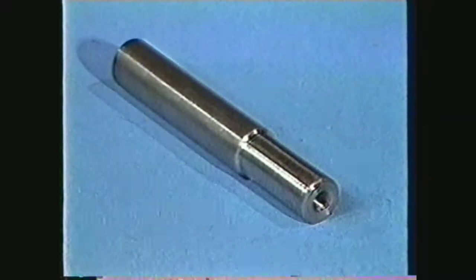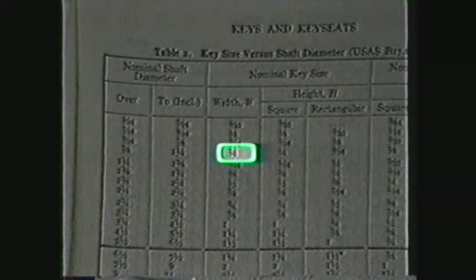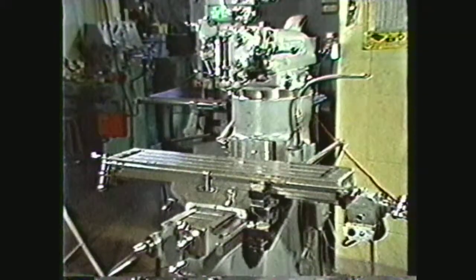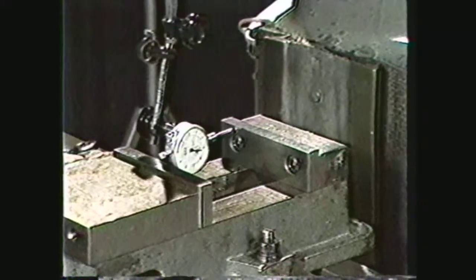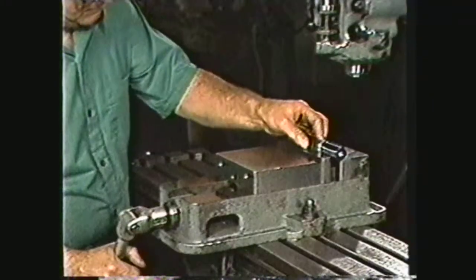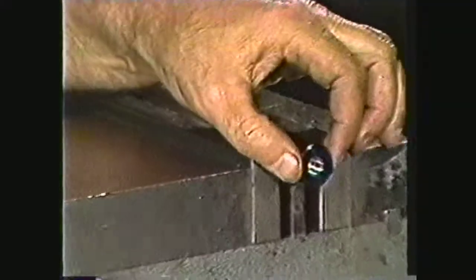In this demonstration, we will be using a 7⁄8-inch diameter shaft. The table in the machinery's handbook shows that a 7⁄8-inch diameter shaft will require a 1⁄4-inch square key. The keyway will be cut with a vertical milling machine. Mount a vise on the table of the milling machine and check it for squareness to the table. The head of the machine should also be checked for squareness to the table. Mount the shaft securely in the vise, leaving about a 1⁄2-inch extending from the end of the vise in order to pick up the cut.